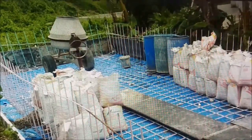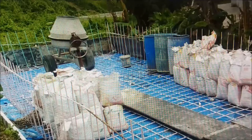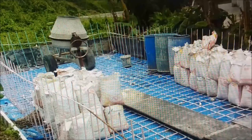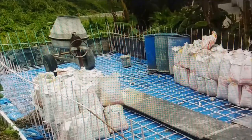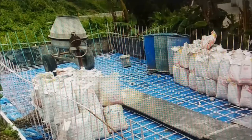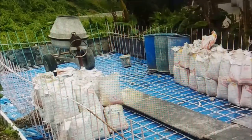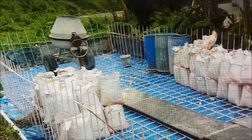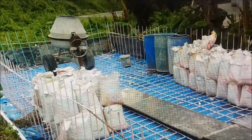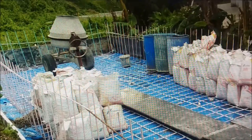The mixer is down at the end. They'll throw the stuff in the mixer, spin it for three minutes, then dump it — you can dump the mixer to the left or to the right. We normally dump the mixer into half of a 20-liter pony keg with a rope handle we put on them — it's about two and a half times as much concrete as you see in other videos. They like that quantity, it's not such a hectic pace. The buckets weigh about 80 pounds, but Bea is in the bucket brigade too — she catches it out of the mixer and slides it down a piece of plywood to the next guy.